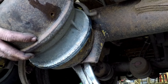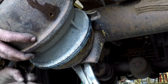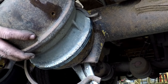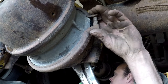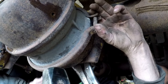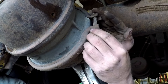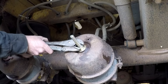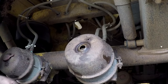You can set your new diaphragm on and then put your half can in place, and then reinstall your band clamp. Tighten down your nut, remove your cage bolt, and reinsert your rubber plug — and that's all there is to it.